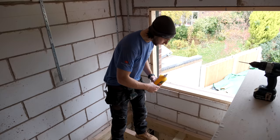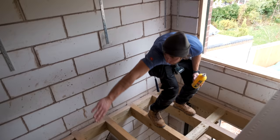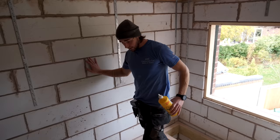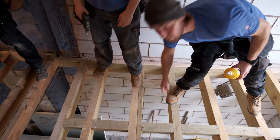We've pinged the line central to where the edge of the board is going to fit, fitting noggins flat side along, running the whole way so that will carry the edge of the board. The end of the board is going to finish just across here, so there's an extra noggin going down there to carry along the edge of the board, ready to be glued and screwed.